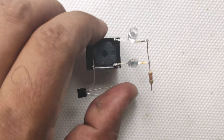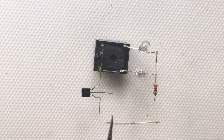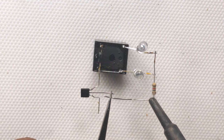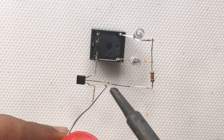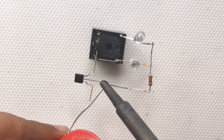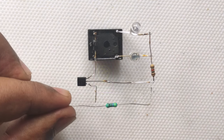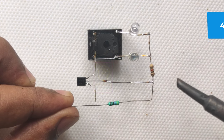You can charge the lead acid battery overnight using this circuit and you do not even worry about overcharging of the battery. Once fully charged, TL431 will disconnect the battery from charging circuit and stay like that until we disconnect and reconnect the input to the TL431 circuit. The circuit diagram is given at the end of this video.